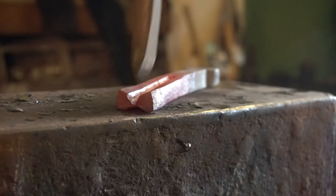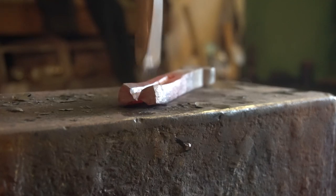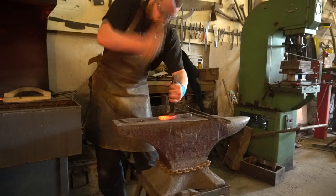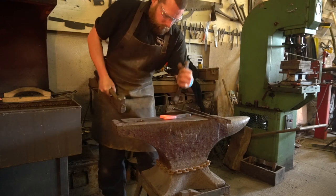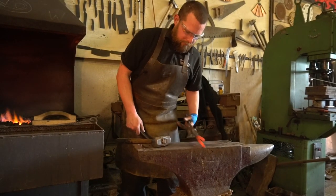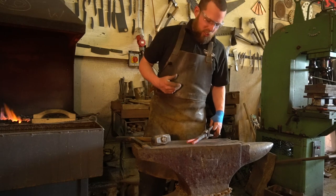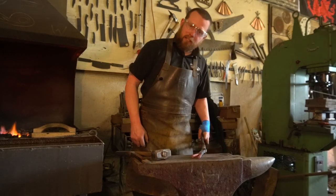As I've cooled down to sort of a cherry red, the bar will start to split. I can use that shearing action to chase that cut, but I do not want to drive my chisel into my anvil. We've split all the way up the bar, all the way to my centre punch mark. Now I'm going to tidy this up a little bit — I don't want to get rid of all of that V-shape. If you've got any untidy ragging or really sharp edges, you can open it up and file those off, but initially I'm just going to give it a squeeze here to tidy that transition point up, and then simply open them out over the bick of the anvil.